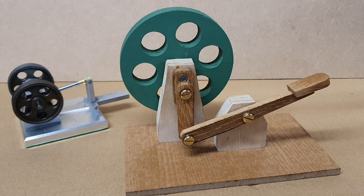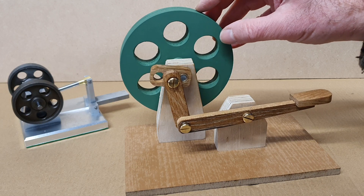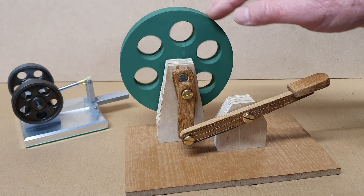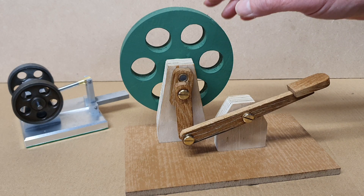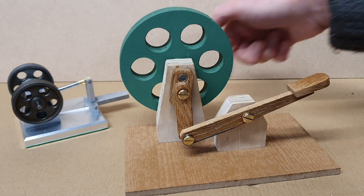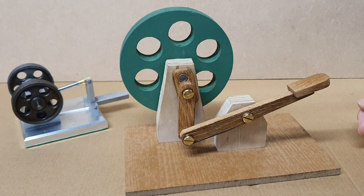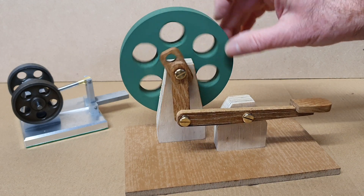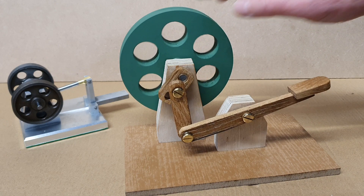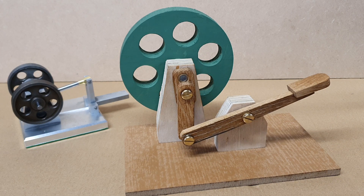The construction primarily is a plywood flywheel which I just sort of drew the shape out with a compass and then trimmed the wood down near to size and then mounted the flywheel on my lathe to cut the perfectly circular shape. I was going to leave the flywheel plain but I thought it would be rather nice to have these holes cut in it to make it look like spokes. I put it on my rotary head and plotted out the six holes very accurately, and then on my drill bench I used the forstner bit to cut the holes in it and just gave it a green paint job just to make it look nice.